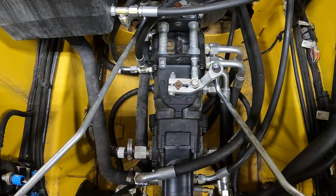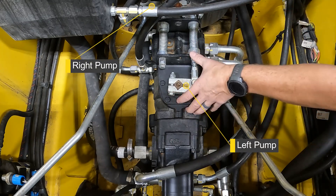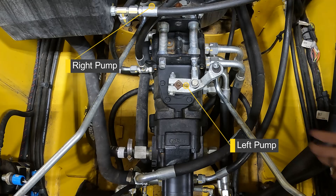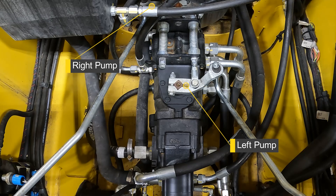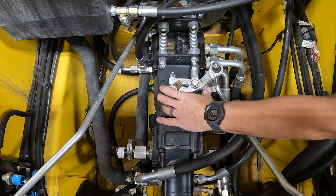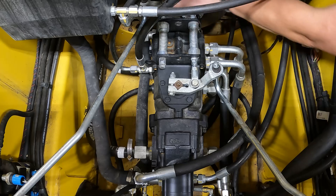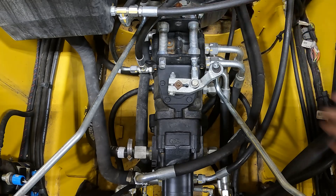When we look at the pump stack we have a left pump and a right pump. The left pump is specifically for the left drive; the right pump is for the right drive. So if you release the park brake and you ID it creeps on the left side only, you would only go after the adjustment of the left pump. Vice versa, if the right side creeps forward or back, you would go through the procedure of centering the right pump, which is the back towards the bellhousing.